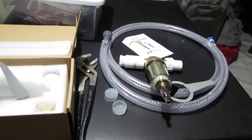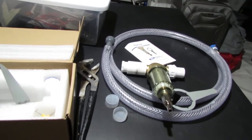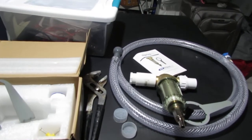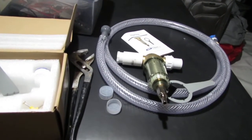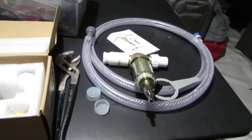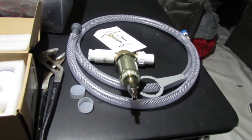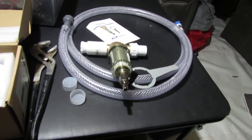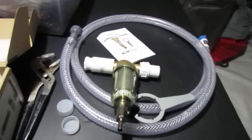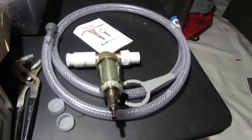If you live in a newer neighborhood, you're at high risk for that, because anytime they add a new home they have to break the water line to add that service, and it's just vulnerable for sediment to get into the system. That's why I recommend adding one of these primary filters to your home — and you probably should do it even if you have an older house, because they still have to work on the water supply system occasionally. Not only that, but if you have a filter going to your ice maker, this will increase the longevity of that filter as well.